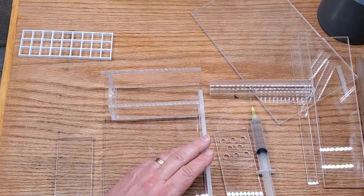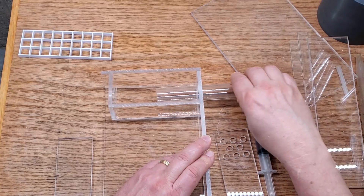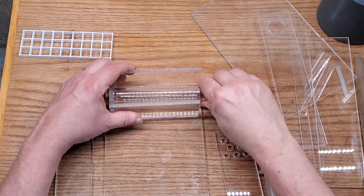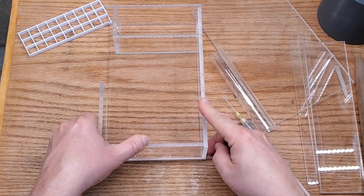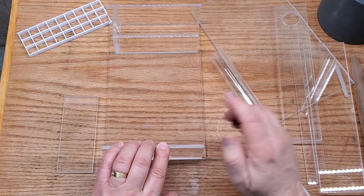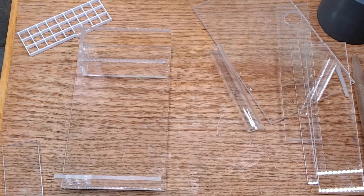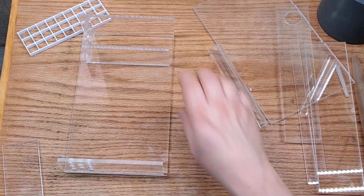To clean this I'd pull it out — you see it's a bit of a fit on the bottom — and then I'd be able to slide the lid out. So the lid is locked in place; imagine those two thin strips as the grooves it fits in. That was how I originally intended this, but even though I messed up on the baffle I had cut the sides really well, so it fits together nicely. I do need to add a small bracket though, because the loose fit for the bottom might allow the lift stack to slide down and restrict water flow.